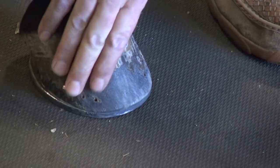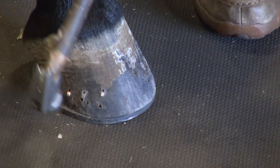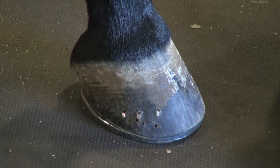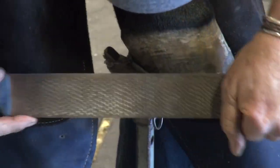So when the test is expired, it's time to come over and evaluate the nailing and finish. First thing they're doing is walking up, looking at the presentation of the job, looking at the nail line, looking at the alignment, looking at the shoe position. Certified candidates seem to get hit harder a lot when the shoe moves when nailing. And there's ways to overcome that.